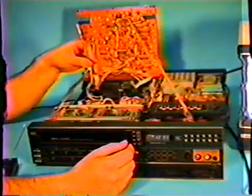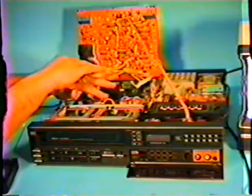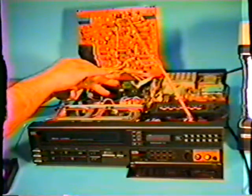Okay, we have the VCR hooked back up. I want to just go over a little bit again. And we plug this in too. I do have it plugged in right now, and as long as you're in a safe area, you can do this with it plugged in. Where you're not on the cement floor, metal. You do not want to work on a metal table. You want to have an isolated table so you have no conduction of electricity. Again, you don't want to have metal things on your fingers because if you're reaching in here, if this board happens to come down, if you have a ring on, you could short something out, cause damage to the machine or damage to yourself.